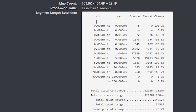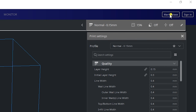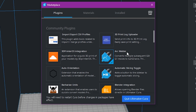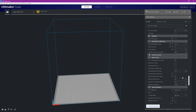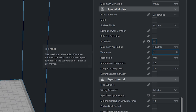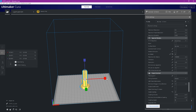Now let's talk about how to get up and running with Arc Welder. We'll start with the Cura installation because it's the easiest. Simply click the Marketplace link at the top, then from within the Marketplace scroll down to the Arc Welder plug-in developed by Field of View. The plug-in directly uses the Arc Welder library, which we'll cover in just a minute. Once the plug-in is installed, scroll down to Special Modes and click the checkbox for Arc Welder. This exposes all the different options to configure the tolerance or resolution. I suggest experimenting to find what suits your needs best.